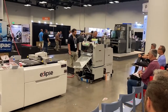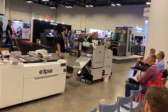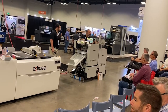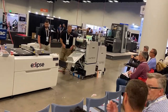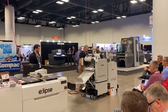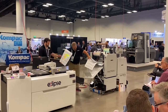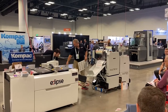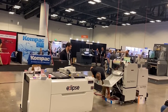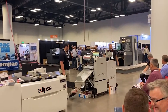So I've just converted the machine from laminate to foil — it doesn't take a long time. There are no other settings I have to change; the pressures we keep about the same. The machine operates the same way — I hit start, drop my rollers back down, and hit run. Wherever we've printed black toner, when the sheet comes out you're going to see foil. The machine will just continue to run on its own, and if you run out of sheets and the feeder stops, the laminator automatically stops.